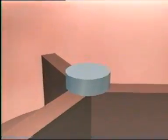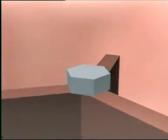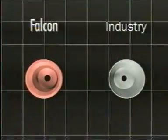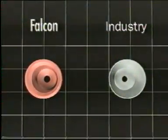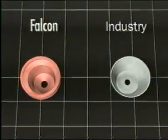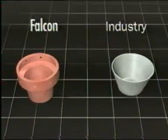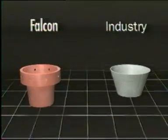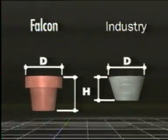Both the SB and the C are not designed with any exotic parts or materials, allowing easy maintenance on site. Although the industry selects machines by diameter, it is the surface area that determines tonnage throughput. The spinning bowl, which is tapered, effectively acts as a pump — the greater the RPM and the greater the surface area, the more tonnage that can be treated. Deeper bowls increase surface area, and diameter has no reference to the amount of material treated.